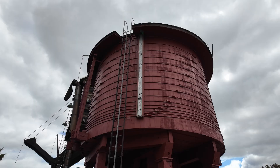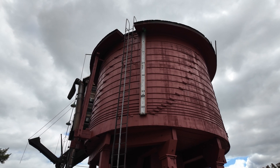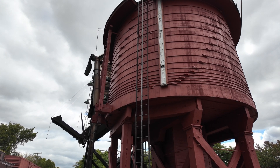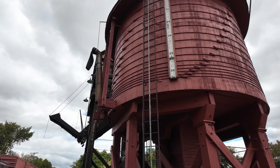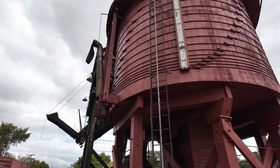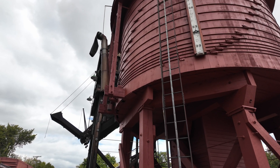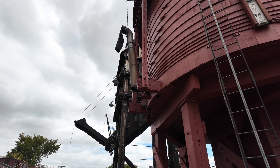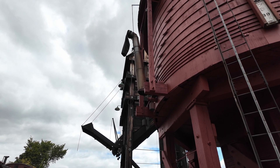As that float goes up, the gauge goes down, so you can tell how much water is in there. Looks like we're about 34,000–35,000 gallons today — that should be enough for today's operations. This is actually on the small side for tanks. Typical steam train water towers tended to run about 50,000 to more than 200,000 gallons, and you needed that capacity because your trains actually used that.